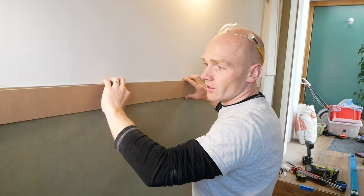All I need to do then is just take the length of the wall minus 5 times the width of our verticals, and then divide it by 4, and that will give me these spacings, and we can just get everything penciled in. Once we're happy, then we can move on to the other wall, then we can have lunch, and then we can work on skirting.